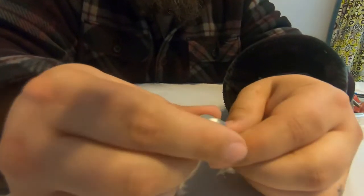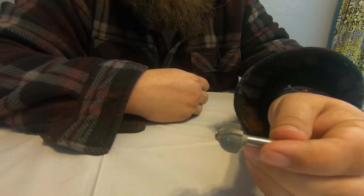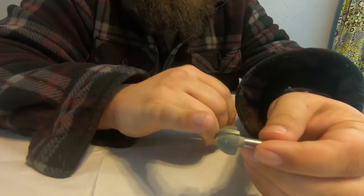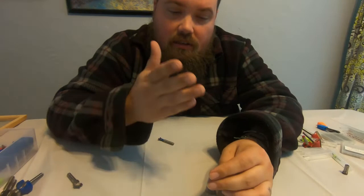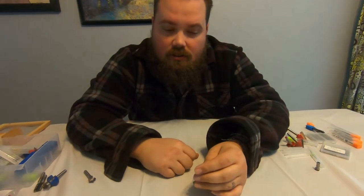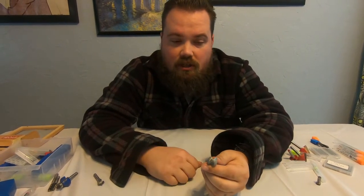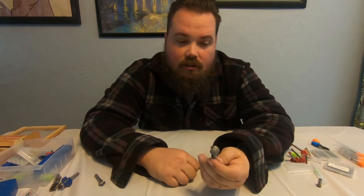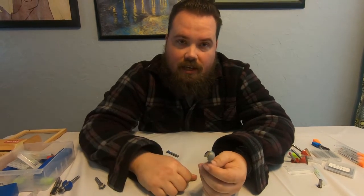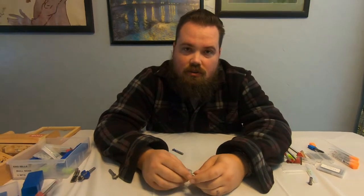Another normal router bit that I actually like to use is this bull nose bit — it's a three quarter. It's very similar to the rounded bull bits we can use for fine 3D cutting, but this is a three quarter bull nose and leaves a very nice round over. It's a good way to make trays very easily and consistently without needing a template or a handheld router — just let the CNC do the work. I do the clear-out work with a flat end mill and then come in and finish with this, and you're left with a pretty smooth finish that doesn't need a lot of sanding.